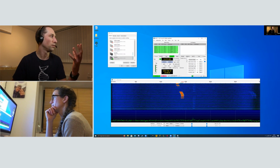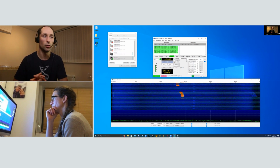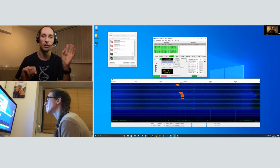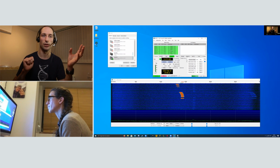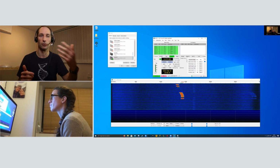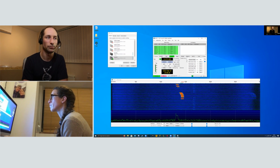So once you've got a decode of my CQ call, which you can see there, double click on it and then press the Enable TX button. What that's going to do is start the software automatically responding to me and working through that sequence of messages.